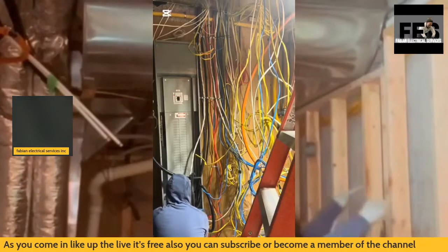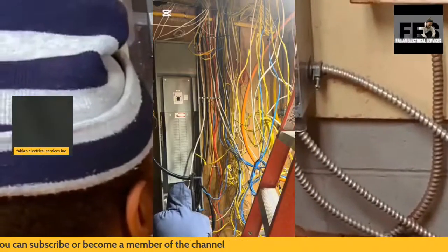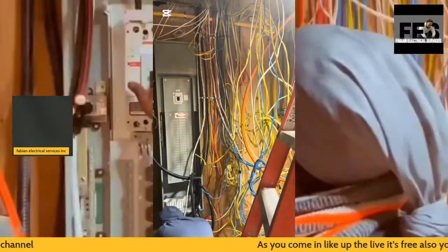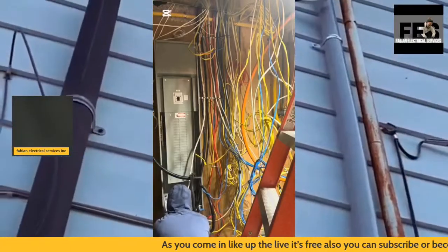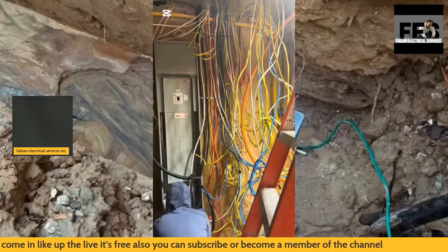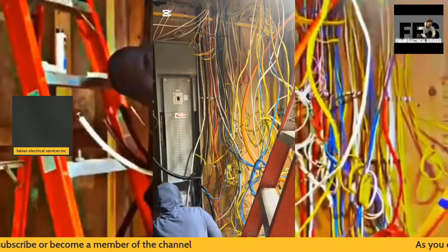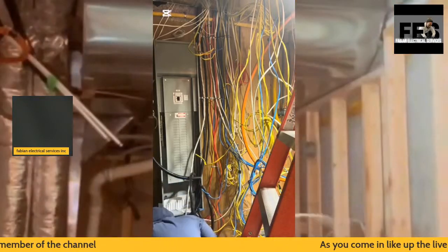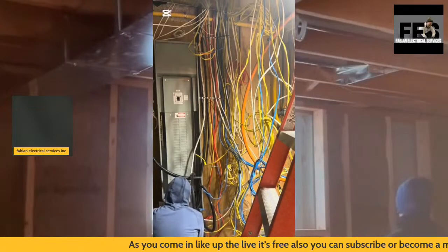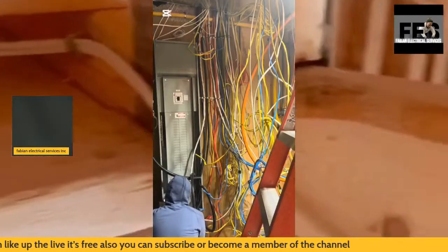Obviously, here in Canada, we use yellow wire that normally goes into the kitchen. So if we see those cables, we already know where they're going. But again, it's best not to assume. Someone could have stepped that wire up to a different size, but normally they are 20 amp breakers. So most of the time I label my cables.